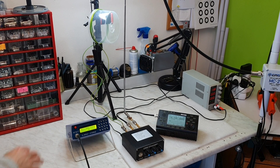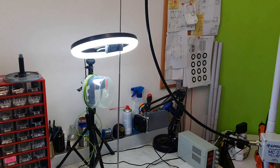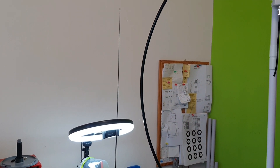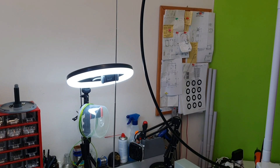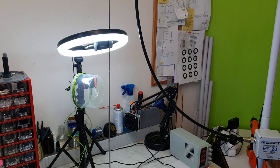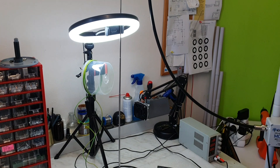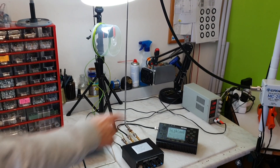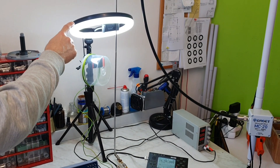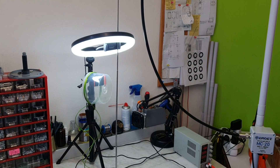As the main antenna, I will use this one-meter-long vertical telescopic whip with a transformer on the bottom. For test purposes it will be placed very close to the LED lamp, and it should pick up a mixture of the wanted signal from the magnetic loop antenna and also the unwanted signal from the noise source — in this case, the LED lamp.